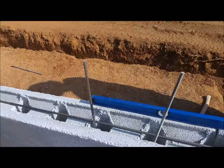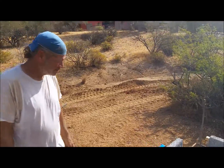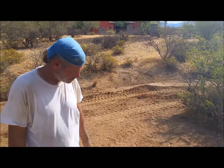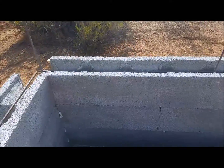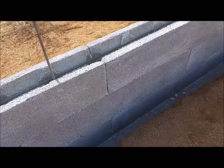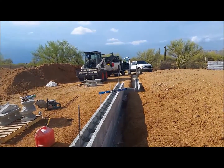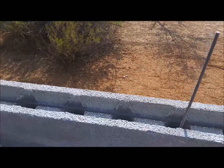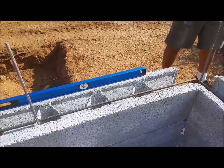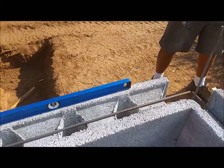I'm going to go down there and get some shots of that footing. This was Lone Mountain Concrete — they poured the footings. I did all the digging and rebar work and just had them come in and pour the mud for me real quick. Looks like they really got it nice and flat and level for you. Yeah, they leveled off really good — good quality work with Lone Mountain. Rebar's all in the right spot, and you're going to take a four-foot piece and bend it around that corner, right? Yeah. Really looking good, Jack.